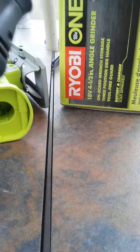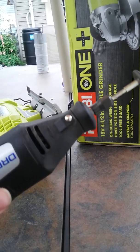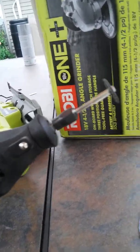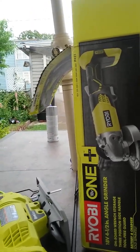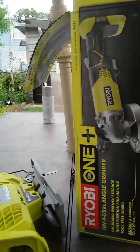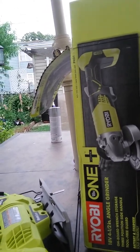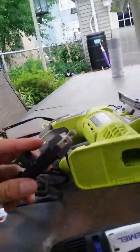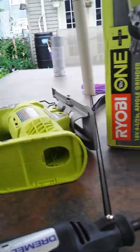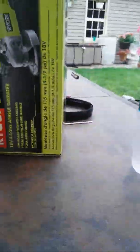I highly recommend this approach — just get some cutting discs and a Dremel tool. The Dremel cost me about $25 and the discs are around $10-12. I bought other tools thinking I'd use them, but the Dremel is more precise and uses real 110V power instead of batteries, which don't have much power.